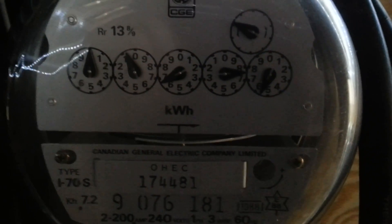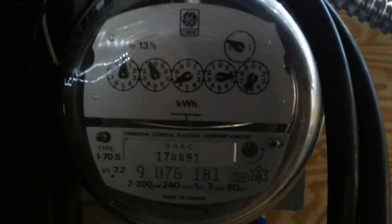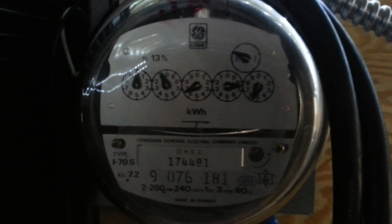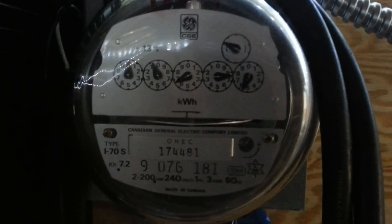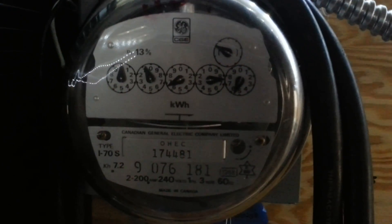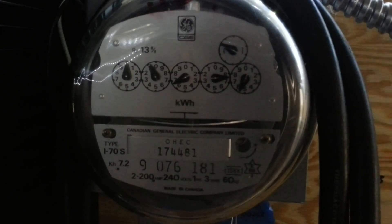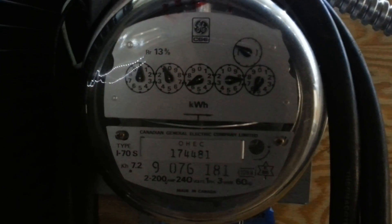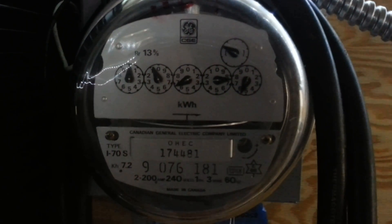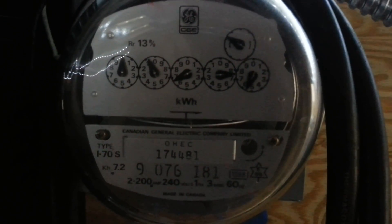This is the inside system, inside the RV. You can see the meter spinning backwards — we're getting credit right now for the energy produced. This is an eBay utility meter, not the actual meter we use for the power company. We're set up for net metering here, so this adds to the solar on the house and gives us credit when we overproduce. It's spinning backwards pretty well — about 2,500 watts right now in the mid-day sun, which isn't bad for panels mounted flat on a roof.